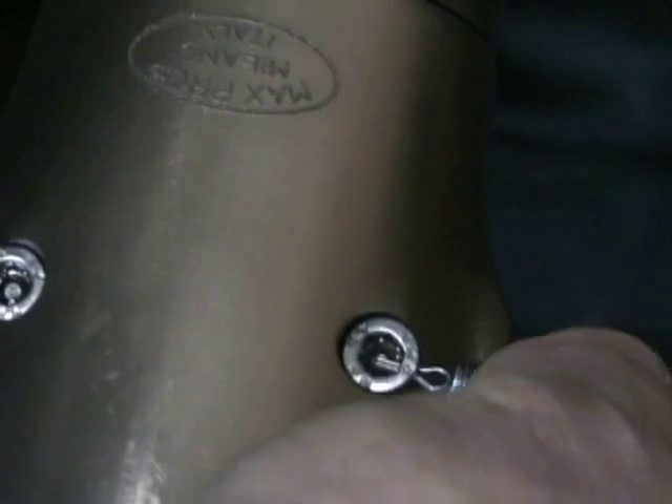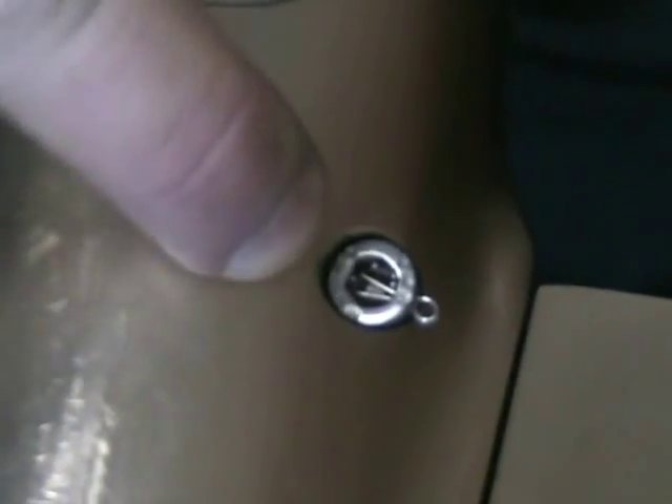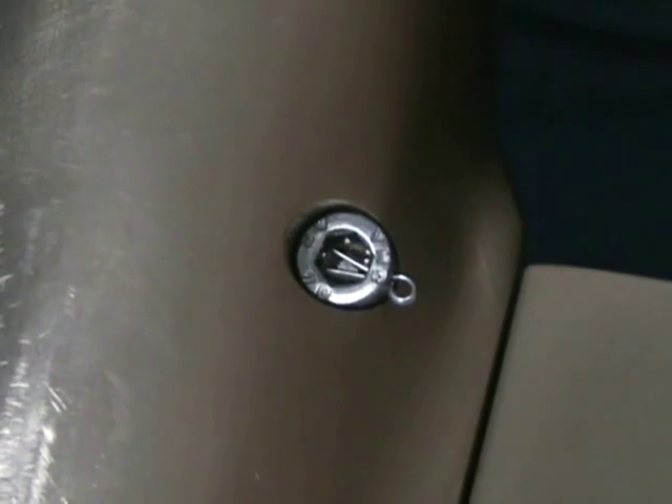Place a nut or a screw at the outside of it, pounding on the head of the cotter pin. By pounding on it, it will spread out the legs of the cotter pin, opening them up so that the cotter pin will not fall out and the screws will not loosen up.